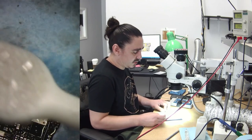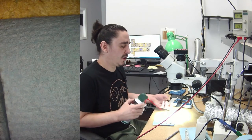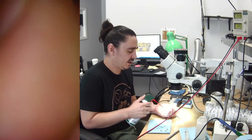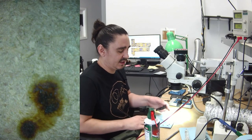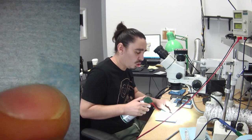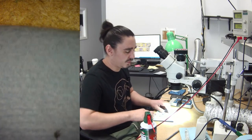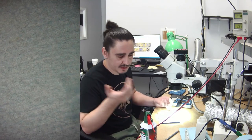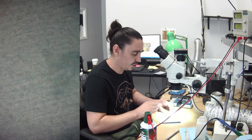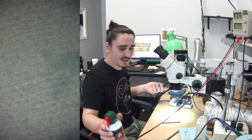A normal missing voltage line, a CPU power rail or a NAND power rail or RAM or something like that, if that coil is missing, or any of the power rail coils are missing, I'll normally see some amp draw and then a steady low current consumption, like 0.06 or 0.04, something small like that. But that's only on certain lines; you can't use that general rule for every single line. Some lines behave differently, and I know I've seen the boost coil missing giving me the zero amp draw. So I'm fairly positive that that's all this one's going to be.